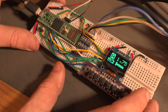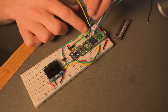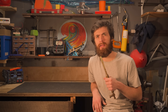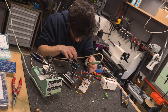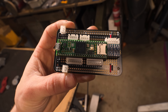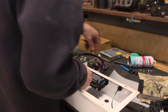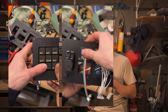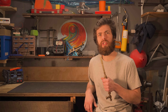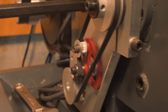Up until this point I'd still been using a solderless breadboard. I wasn't sure exactly how I was going to mount the Teensy and all of the required connectors, and then it hit me: if solderless breadboards are a thing, then surely solderable ones are too, right? I somehow only just found out about these things, and frankly I'm quite disappointed because no one brought them to my attention. With our main control board looking slightly less prototype-y, it was time to cram it into the lathe's electronics enclosure, along with a 5 volt and a 48 volt power supply and the motor driver. I added the keypad, screen, and main switch to the control panel, then carefully jammed the mess of cables inside, all the while crossing my fingers I hadn't crossed any wires and turned the entire lathe into a general purpose outlet. And with that, I had myself a perfectly operable electronic gearbox.